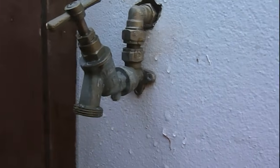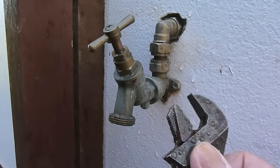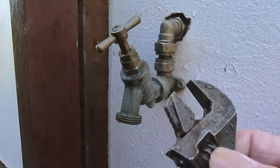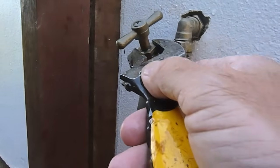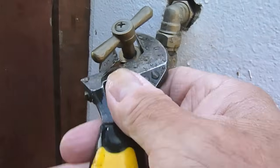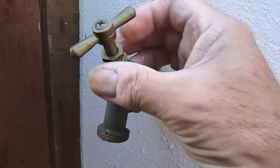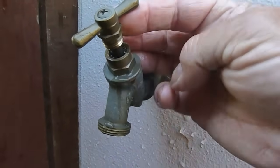There's no need to turn the water off at all. All you need is a little adjustable spanner like this one - just get a cheap one. Get it on the gland nut there like so, and turn anti-clockwise. Just need the tap shut off and turn this out.